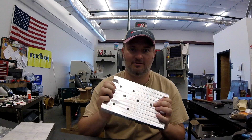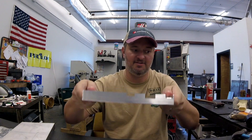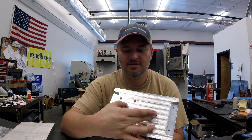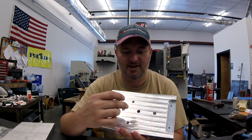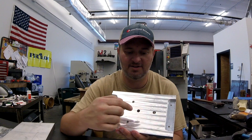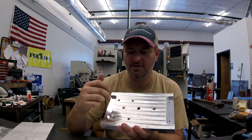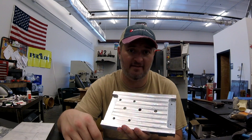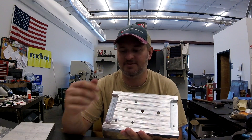One of the things he does is put those little cutouts in here — he gets really fancy with 3D finger grip kinds of things. I just needed to be able to get it on and off easily. You'll see there are three holes here — this one's a through hole but these two are locating pins. I drop it in, I was able to take it off and repeat back and forth without making any big change. This through hole is what's going to bolt it in place. I don't have space for multiple bolts, but I've got pit bull clamps I can use on the outside if I need more downward force.